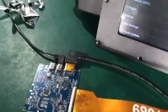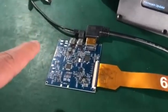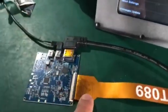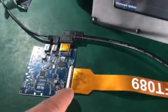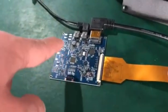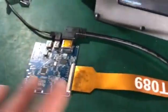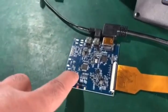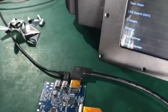So those are the main reasons you may not receive an image on the LCD screen on your Duplicator 8. Make sure the HDMI cable is not defective, and make sure the ribbon cable connecting both sides of the HDMI controller board is plugged properly. If you turn on the printer and the light on the board is solid, that means everything is okay and you may need to replace the LCD screen itself.